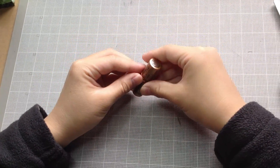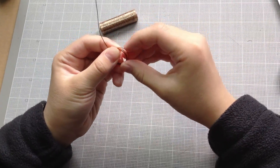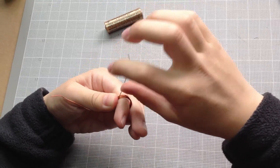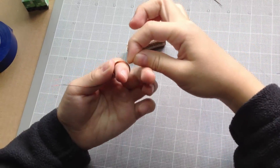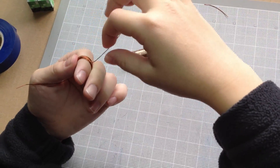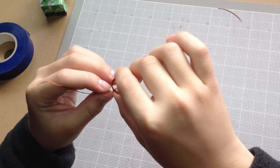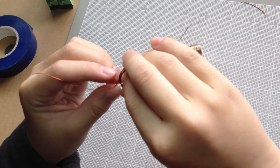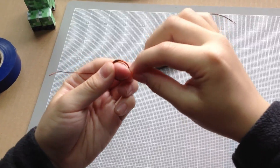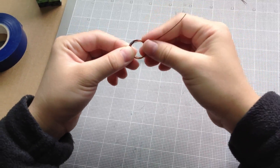Now you're going to have to take that off. Make sure you put your finger through it so it stays as a coil and doesn't uncoil. Then coil it around more until these two ends are exactly opposite. It's important that they're in the middle of the circle, or else the motor won't work properly. It's a bit tricky. I think I've got it in the middle-ish.